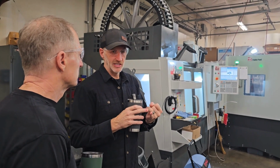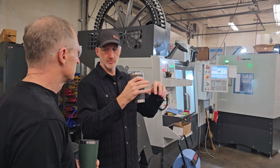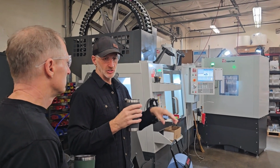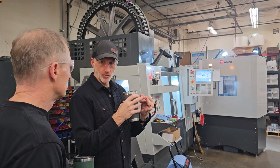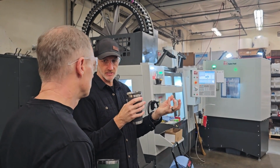Cutting tools is one of the first things you learn in machining: what cutters do I use to remove the material, right? Because usually you're just throwing a part in a vise and you clamp down the vise and that's it. But as you get more advanced, the game becomes how do I work hold? How do I hold the most amount of material? How do I hold that particular part in the most unique way that I can machine as much surface as I possibly can, without changing it?